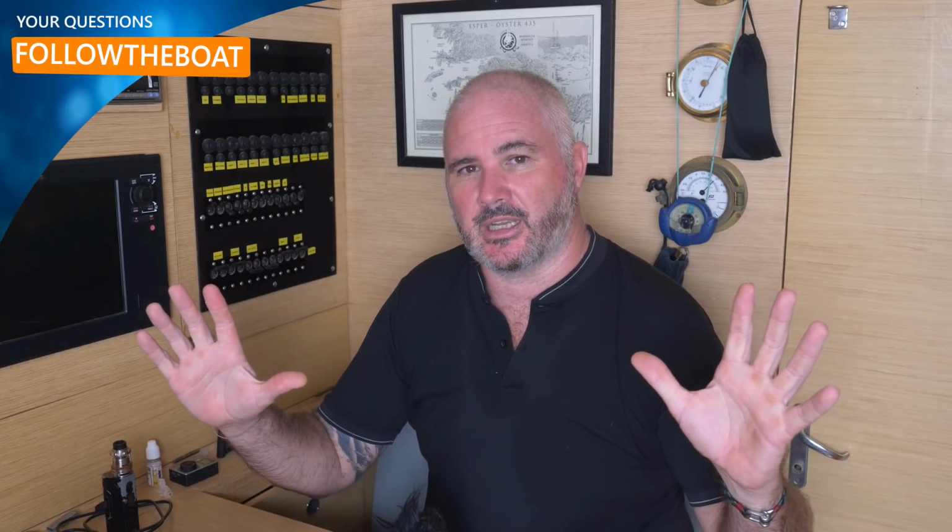If the anchor's dragging, the person on the bow will be able to tell you because they'll see the chain doing this, and you may even hear the anchor dragging as well. But when you're happy that it's bitten, put the boat back into astern, and again, not too much, but just enough so that you pull that chain taut, and you should be able to let your hands off the wheel and keep it in astern, and it should hold it there. Now, I mentioned 3-to-1, and in 10 meters of water that we'd put out 30 meters initially. We tend to put out more than that.